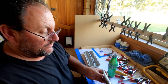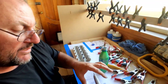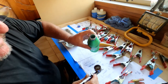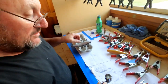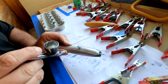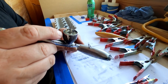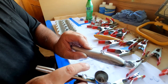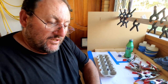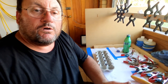Now we're in the paint room. The Araldite has been cleaned off and gone nice and dry, so we're ready to go. We just want to put a little bit of paint in that area to neaten it up and make it look nice. We'll put a bit of paint in the paint gun — make sure it's working, that's pretty important. Now all we've got to do is lightly spray the silver over the top. You can still see there are some lumps and bumps, so we'll put two coats of epoxy on, then come back and re-spray that area to make sure you can't see any imperfections of where the glue was, then it'll get another one or two coats of epoxy.